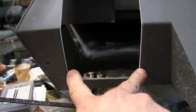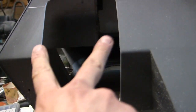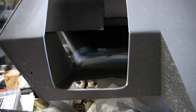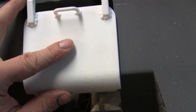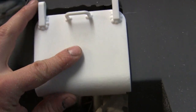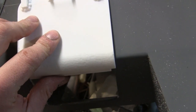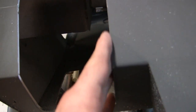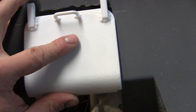After a few passes with the file, I really did a good job straightening out the cut lines on these sections. One side effect is that removing material to even it off has now widened the gap of the hole. So if I take the door and put it in its location, there's about a little over an eighth of an inch of gapping present. That should be within margins, so I'm not too concerned, but I am going to address it by building up one of these sections with some sheet styrene or styrene bar stock to eat up the remainder of the space and give me a tighter hole.